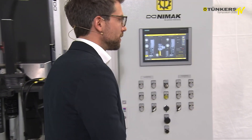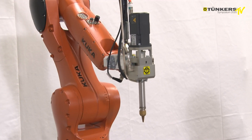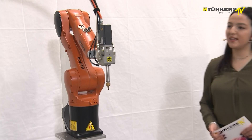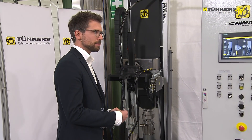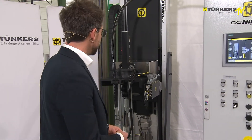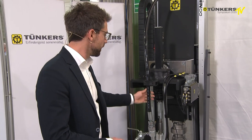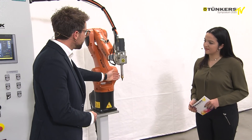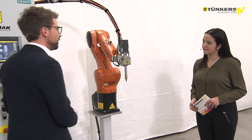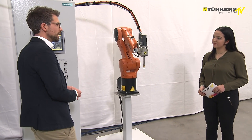And here at the robot — this is a 10-kilo robot — we have the Smart Dosing Plus application head. What does the Plus actually mean? The Plus means that it is a further development of our Smart Dosing system, and it means specifically that we can control the material flow not only with the electric pump station, but in addition, there is an enhancement of the application head. That is, in the nozzle, we can also adjust the opening angle so that we can really adapt the material flow to the specific process.